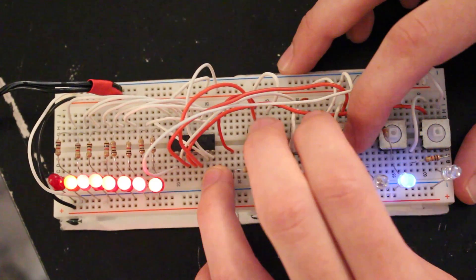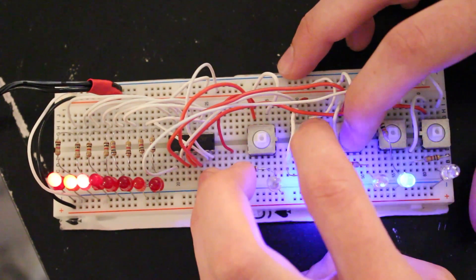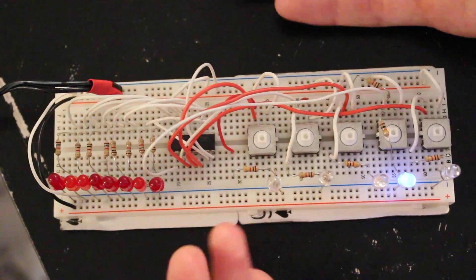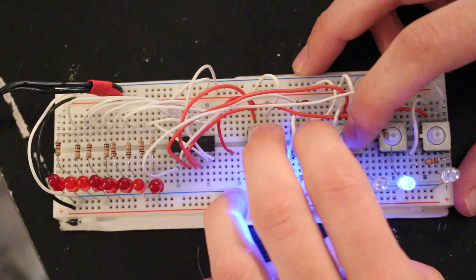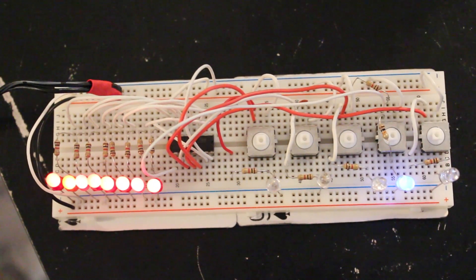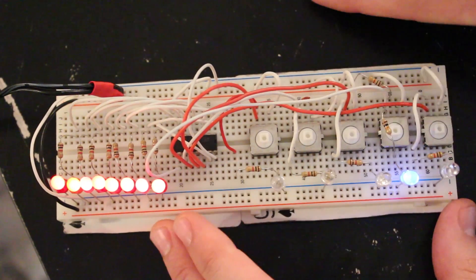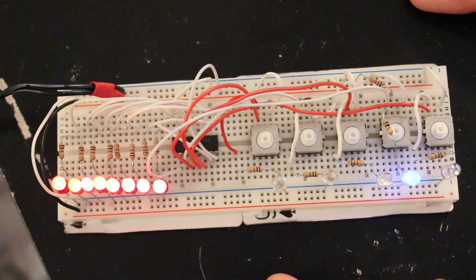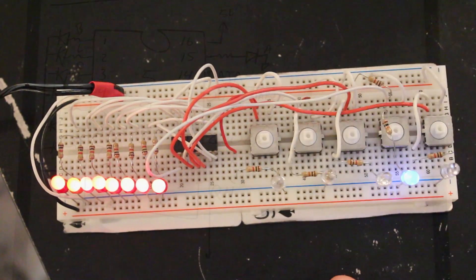I'm going one, one, one, one — and now I'll go zero, zero, zero. It's kind of cool with shift registers: you don't have to latch your data from memory over to the outputs immediately. Usually that's not how you do it — you'll bring in all your data first, and then when you're done you latch it. Anyway, I just wanted to show you how this all works again. You should probably watch the previous video where I get into the details, but what I want to show you now is how everything's hooked up, so let's jump over to the whiteboard.